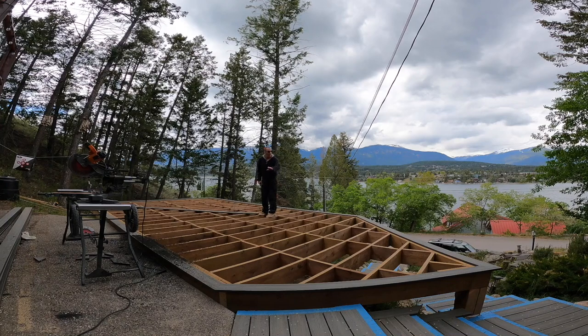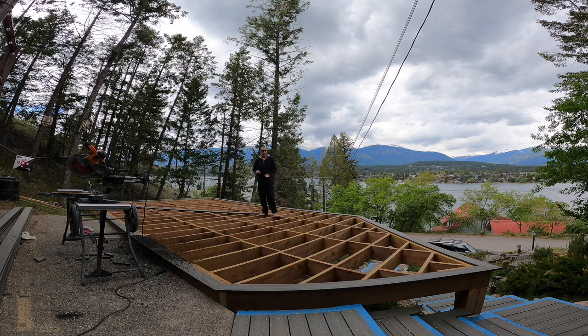Alright, so I got my picture frame all complete. It's hanging over about 2 inches all the way around, which is perfect. Now my miters look really, really good. I took some extra time making sure that's all perfect as well. Got a wicked blade on there. It's a Diablo plastic cutting blade, and I think it's made for plastic laminate, but it just shreds through this composite decking, making miters so perfect. So I definitely recommend that.